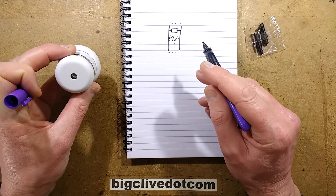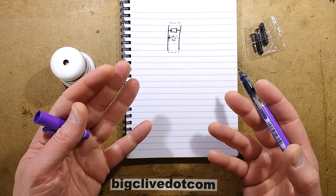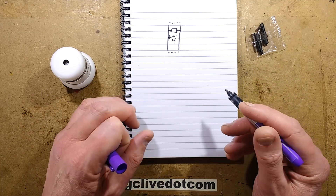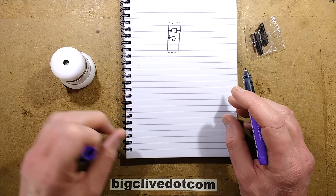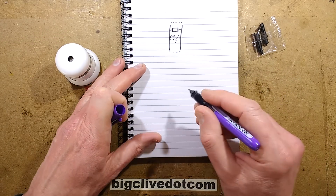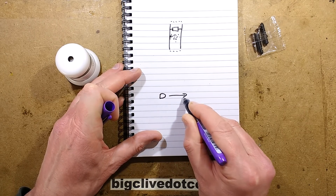The optical detector will detect slow smouldering fires, which is important because if a fire is smouldering in a room it will start consuming the oxygen, and there is a risk that carbon monoxide levels could get quite dangerous. That's the main advantage of the optical type. The optical technique uses an LED that emits infrared light.